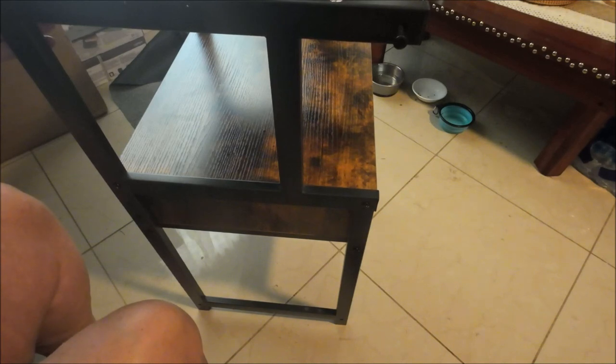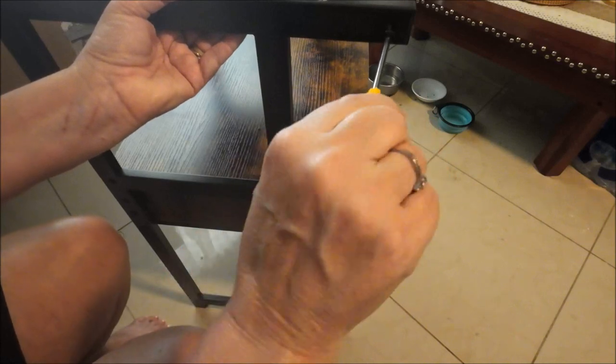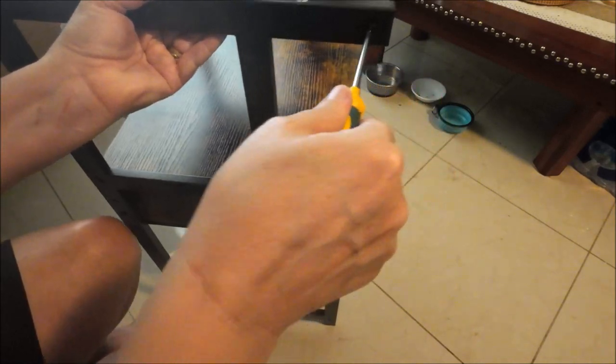If you've done 100 of these, you can use a screw gun, if you're real careful, because you know about how much it takes. But if you've never done one before, you're just going to keep screwing until it stops, and it won't stop. It'll just strip out. That's why they make these handles so small. Because if they made them bigger, you'd get more torque and you'd strip them out. It's going into sawdust, really. Sawdust and glue.